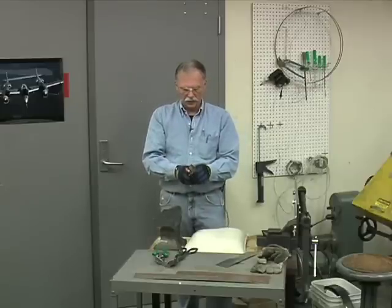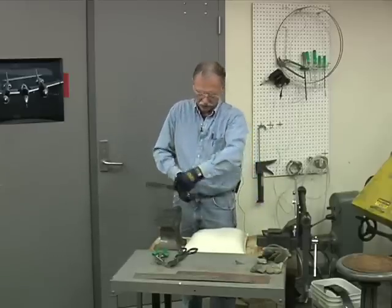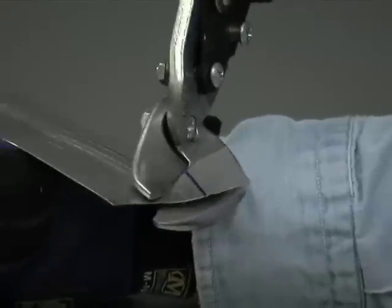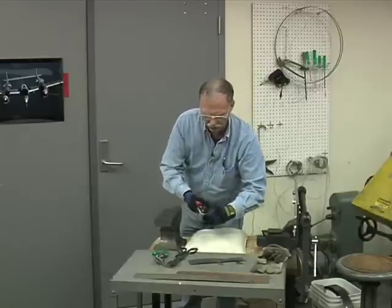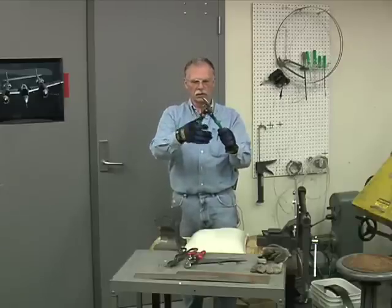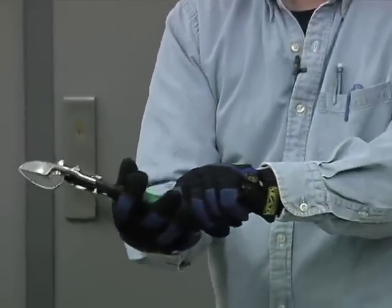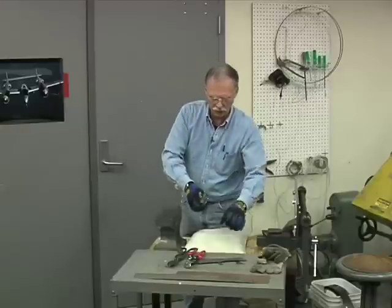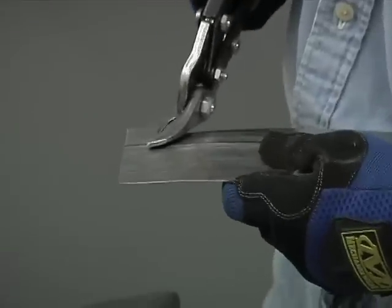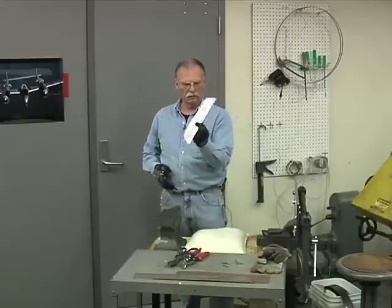However, with these little darlings, these have serrated edges and very stiff jaws, and they're designed for turning when you cut. So here, I will make a little arc, put them back, that's turning to the left, these are turning to the right. And FYI, notice you have these little indexers, these little hilts. The one that's most forward is for the thumb and index finger. The index finger and the middle finger straddle the second one. That gives you the best grip. That's where you choke up on it and you've got leverage. So these are cutting to the right. They have a hook in the blade that allows them to turn one way or the other. So there you go.